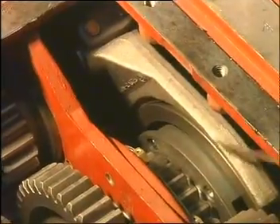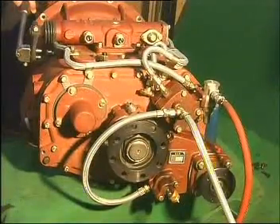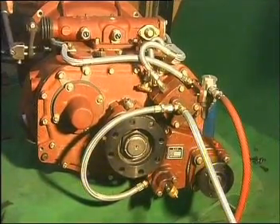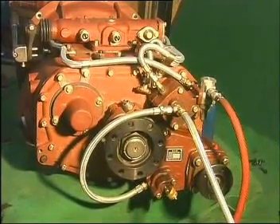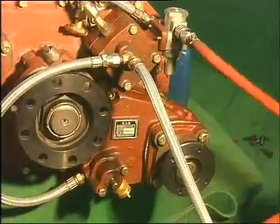The air pressure is about 0.7 to 0.8 MPa. According to the specific situation, shift the controlling lever to the required position and the PTO starts to work. Engage the electromagnetic valve, then use the PTO when the truck is static.